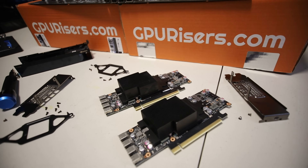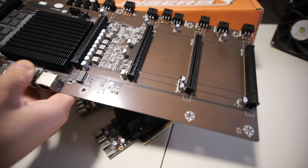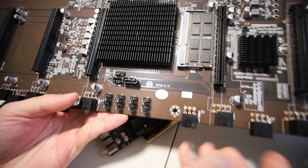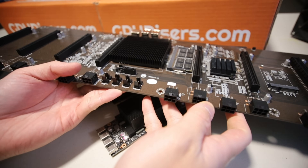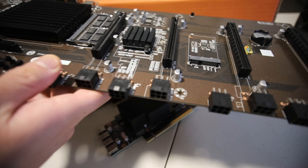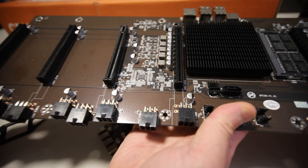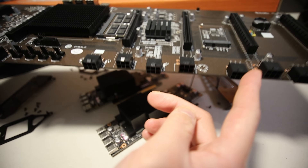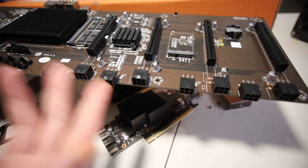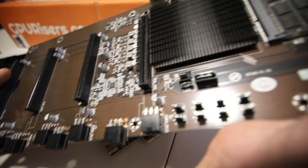What I am going to have coming up is testing the A2000s on a riserless motherboard. I have a BTC65V1.01 riserless board that I got from beescryptomining.ca. I'm going to try placing eight of the modded A2000s — because I have 12 of them that were modded by jkgventures — and I'm going to see the biggest thing: if I'm going to burn this motherboard if I have eight of those modded A2000s on here, because they're going to take about 85 to 90 watts at the PCIe slot, which is more than the spec of 75 watts of PCIe.